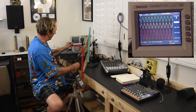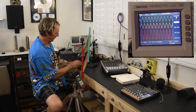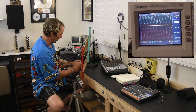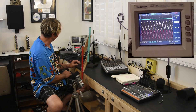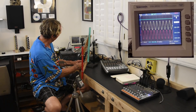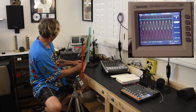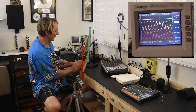We can look at the scope to demonstrate the unbalanced signal. I'll short one pin to ground — there we go. Now I've shorted this pin to ground and we can see the yellow trace got bigger while the output stays about the same. So that's an unbalanced signal: we double the size of the yellow versus the two smaller signals that are out of polarity and added together, giving us the output.